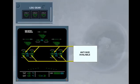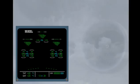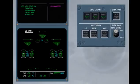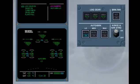Note: the blue 'release' indication means released and is a label only. Airbus recommends the use of the autobrake on contaminated runways or when operating in low visibility. For landing, we will use the autobrake — set the autobrake to low. The following indications confirm the autobrake is armed: 'On' in the selected push button, autobrake low in green on the engine warning display, and autobrake low in green on the ECAM wheel page.